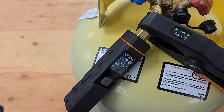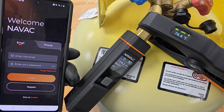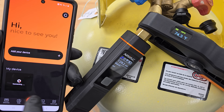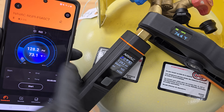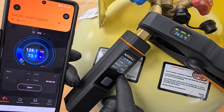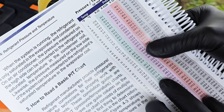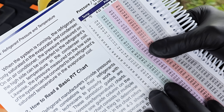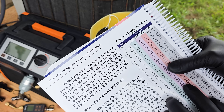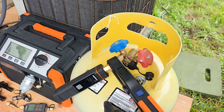This is our refrigerant charging book, and you could use the NAVAC app for this to get the saturated temperature. We can sign in as guests, turn the Bluetooth on, and once the app connects you can assign a refrigerant to this pressure. We already have R22 selected and it's saying it's about 73 degrees as a saturated temperature. On the PT chart, R22 at 125.7 PSI is 72 degrees, so a little bit higher would match 73°F. So that confirms we have R22 in here because the PT chart matches.